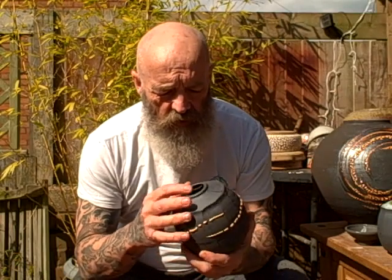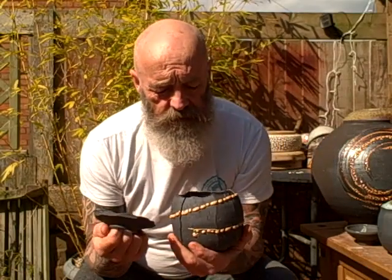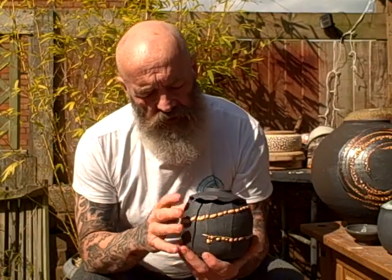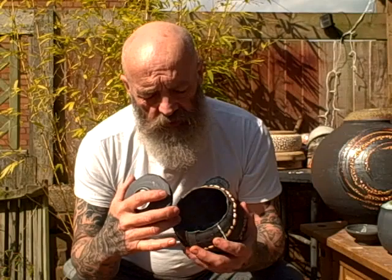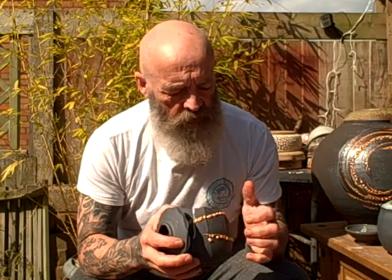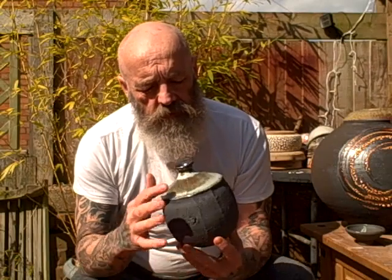Good and bad, 50/50 — I've had better firings and I've had worse ones. First, the failures. This is some black clay that I used — I mix it 50/50 with ordinary clay — and you can see what's happened: they've all cracked, every one of them. It's a shame because I like the spiraling crawling glaze. I think what's happened is because of the heavy reduction it's very thin, it's got carbon coring so it's gone brittle and it's under tension, so it's all sort of breaking apart.